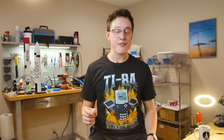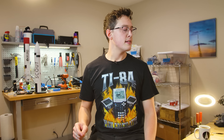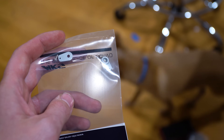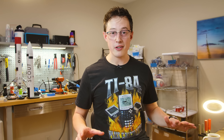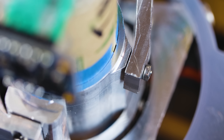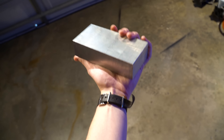Here's the plan. I want to pull out all the stops on this hardware, so we're going to start off with the fastest servos I can find. These little servos have a metal servo horn with an incredibly tight tolerance fit, so there's effectively no slop coming from the servos now. Those Z-bent 1mm pushrods before? Not good enough here. We're going to make our own custom length and shape linkages to push the mount, which gets rid of all of the bending. As for the rest of the mount, all metal as well. If we're going to make some parts metal, we might as well do the whole thing, and I'll get some good machining practice.